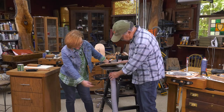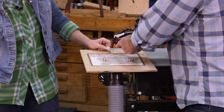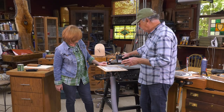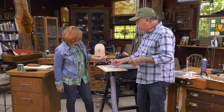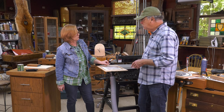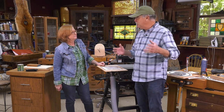This is a King scroll saw with a PS Wood number five Super Sharps blade, which has 12.5 teeth per inch. It just makes great cuts — it's a sweet little blade. And it's thick enough that they don't have a tendency to break.